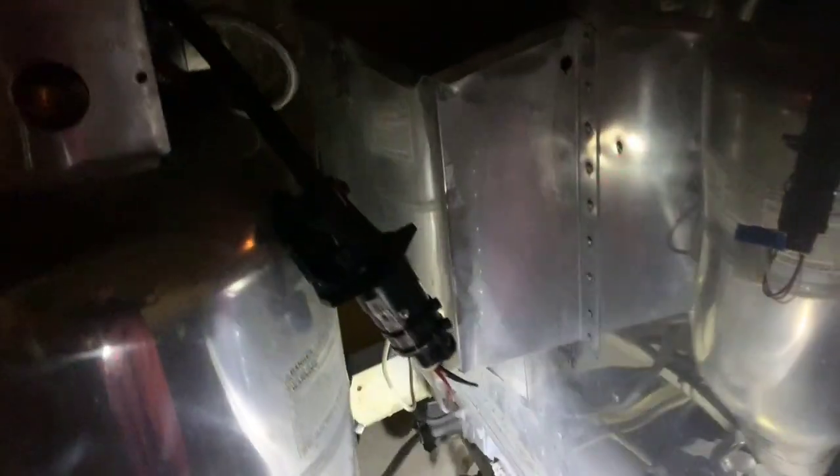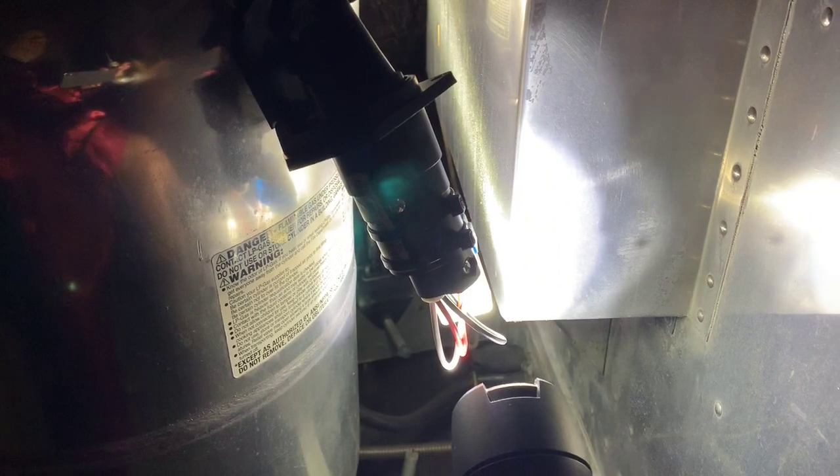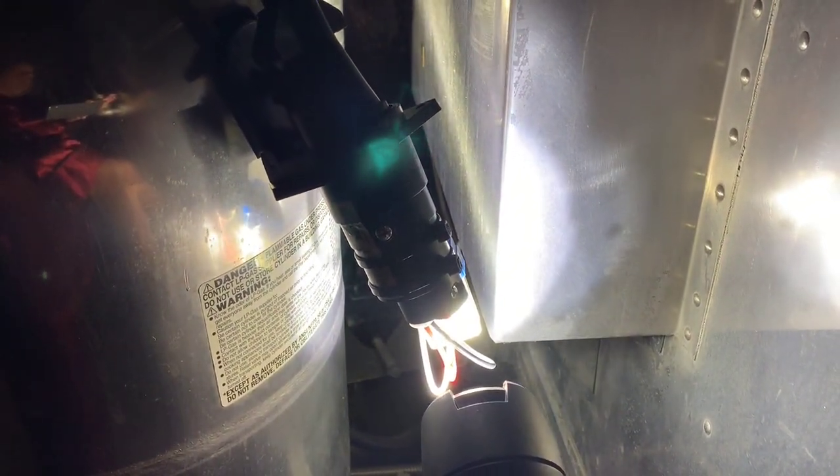What's nice is to have LED lights in all your running lights and tail lights, so you don't have to worry about drawing too much power, especially if you're boondocking. Basically when you set up camp, you plug this in — just like that — and then every night they'll come on automatically. I'll show you what happens if I shine the light on it again, like in the morning — they'll turn off. What's nice is that the circuit inside that relay has a bit of a delay, so when there's a shadow cast or just the slow change from dusk to dawn, it doesn't go on and off. It's called hysteresis — it has a delay before it kicks on. I'll remove my flashlight again, it'll sense the dark, and there you go — automatic running lights.